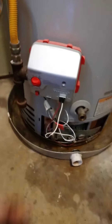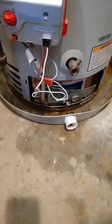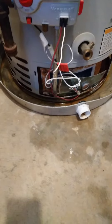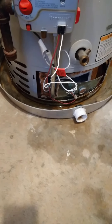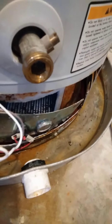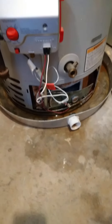Once you see water starting to drip from the relief valve, the water level has come up and the tank is filling properly — you're pretty much done. Go back and set your heater to the temperature level you want. Also worth noting: this is actually a sealed heater and I removed the panel with the sight glass because you can't see anything through it after a couple of years — it still works fine. Keep an eye on the drain valve; make sure it is completely sealed. You can put a cap over it for extra safety, and that's about it.